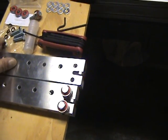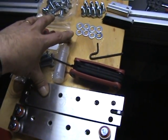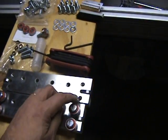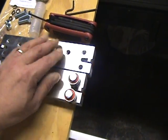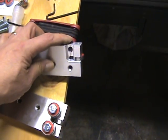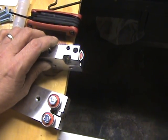The other one uses a bolt and a nut along with the washer. Same scenario — the bolt goes through the bearing, lock washer goes on the other side, except they go through the slotted holes in the extended carriages. There's also a set screw used for adjustments; the nut sits in here so you can tighten it up.